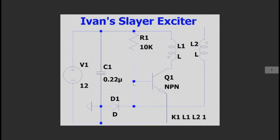it off. However, a current can't exist without a voltage, and the secondary coil has a higher inductance than the primary coil, and therefore will produce a higher voltage at a lower current. Now, unfortunately, we may end up with a fairly high negative voltage on the Q1 base. So in order to clamp these negative transients, while still allowing some current to shut off the transistor, we're going to want our clamping diode D1 just to protect the transistor.